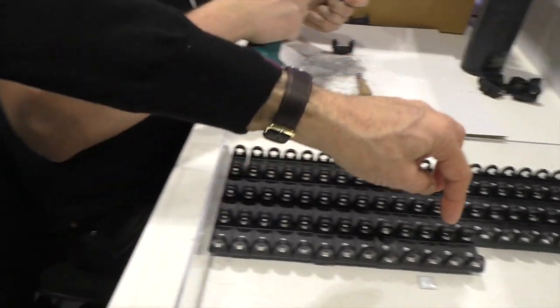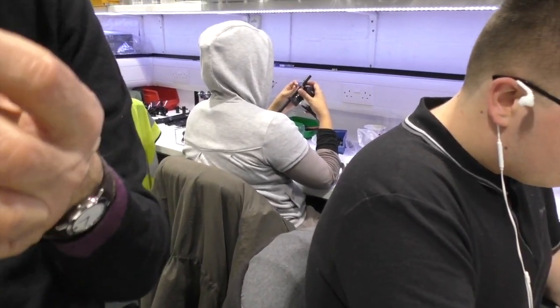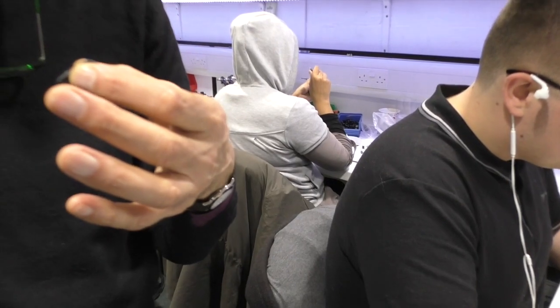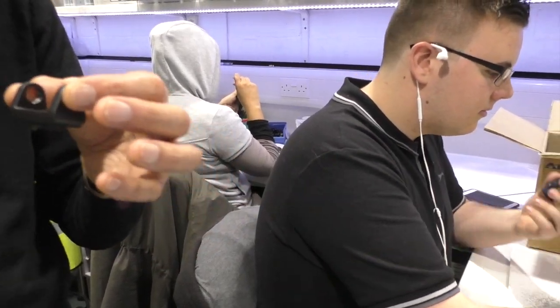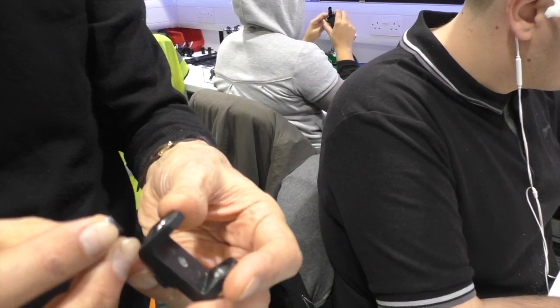And what's going in the garbage there? This is after he takes the multiple part processing. That's a die casting. After the die casting, it has to be what's called fettling, which is taking off the flash from the casting. It's then put in a machine that's rumbled, which is vibrated with ceramic chips to get a nice smooth finish. They then come to us. We then quality control it. You'll see that in a while. Once they're quality controlled, there will usually be some additional processing, and they're sent out for finishing, powder coating. Now there are threads in there, so they have to be masked.